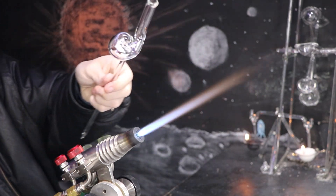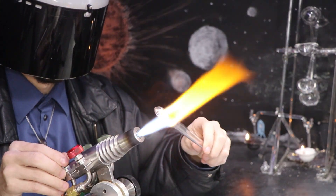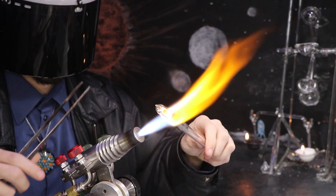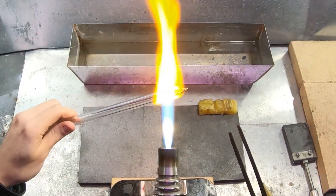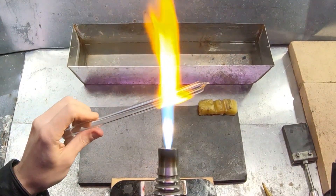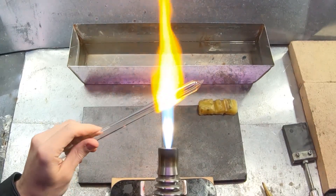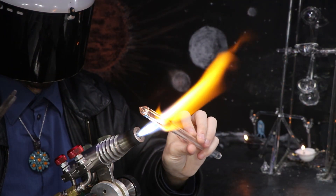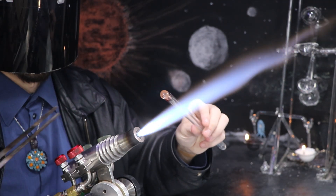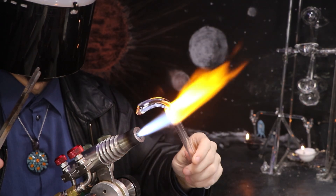I popped a hole and then flame-cut the rest of the tube off. I'll use separate tubing to create the bottom and then attach both of them in the flame. When you start on a new piece of glass at room temperature, it does take a moment to get it up to working temperature, which is right around the melting point. Once you're up there, it only takes a few seconds in and out of the flame to do your work. It takes about 10 to 15 seconds to reach working temperature in the flame, but about 10 to 15 minutes to get back to room temperature outside it.